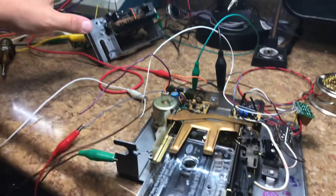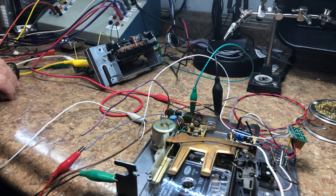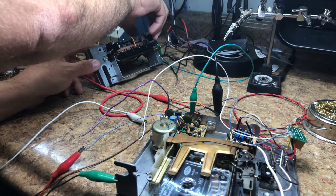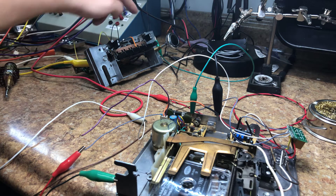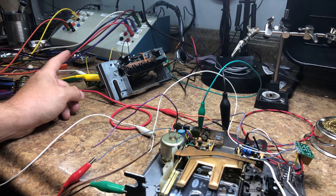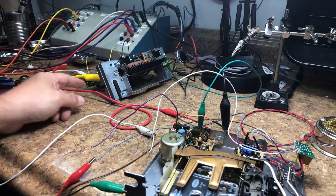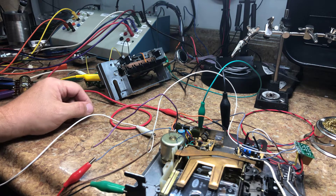The tuner is working great, the band switch works — so now we're in AM, back to FM. Don't get wrapped around these being backwards. Frank is an older unit; he has a facelift but the original chip, and it was designed to only switch with a grounded switch in AM. Unfortunately yours is hardwired to always be FM. The newer boards are either/or, so don't worry — it'll work as advertised.